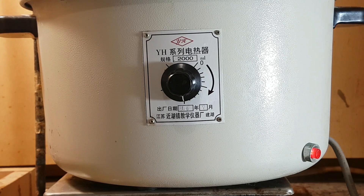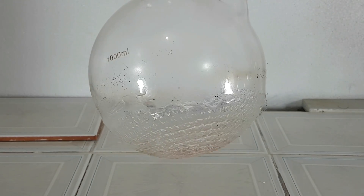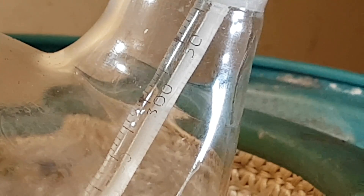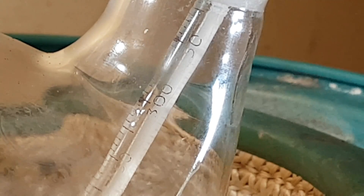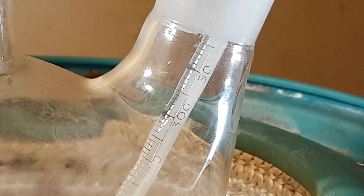Place on a heat source under medium heat. Don't use full heat — if you do, your flask might not like it. As the sieves heat, you will see water vapour escaping. Heat for four hours between 300 and 350 degrees Celsius.